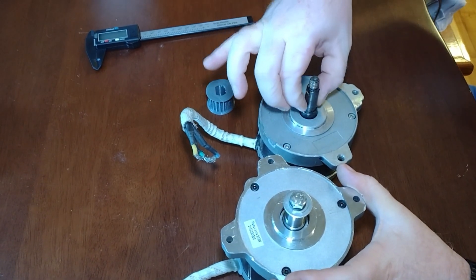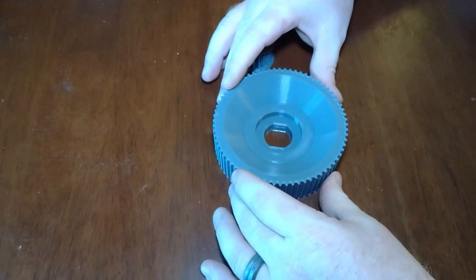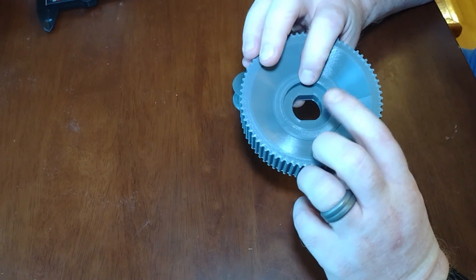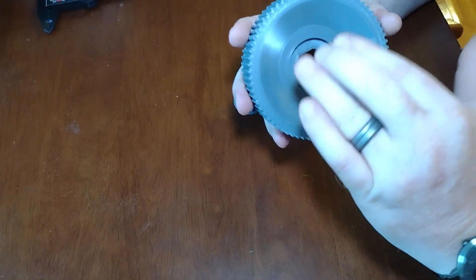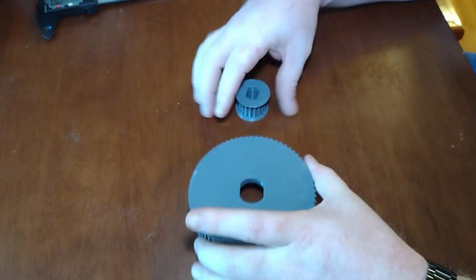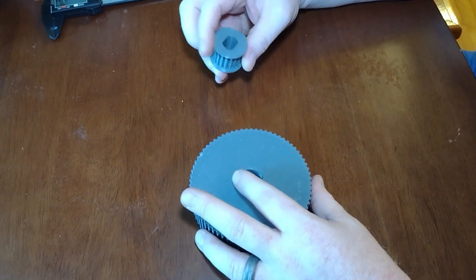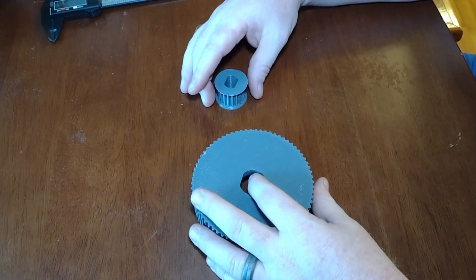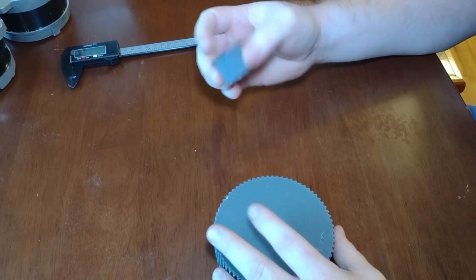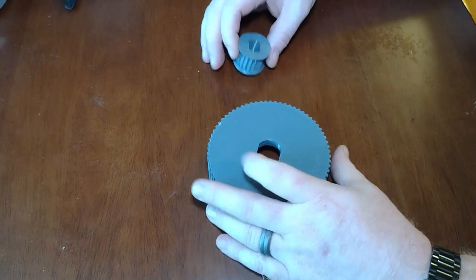The motor mount works with either motor, and I also have a pulley shaped slightly differently to fit this one. On the mower we have a single-speed transmission. The metal insert from the original steel V-belt pulley fits directly into the 3D-printed pulley — it has to be pressed in; I made it incredibly tight. That gives you a 72-tooth pulley on the mower and a 20-tooth pulley on the motor, maintaining the same gear ratio as the V-belts, with no slipping problems.